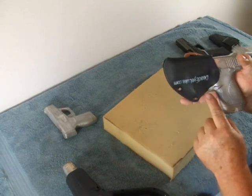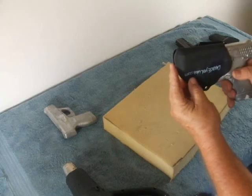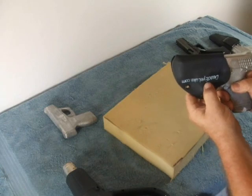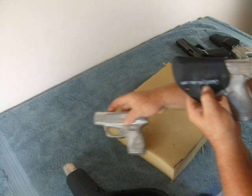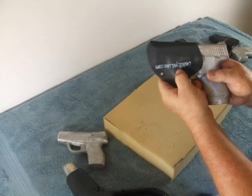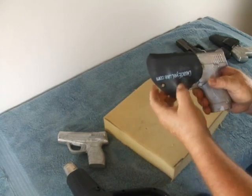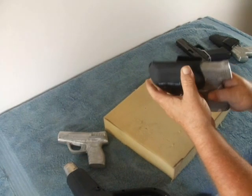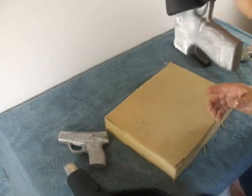You should see the shape of the gun embedded in the holster. Now it's still a little bit warm — you can see it draws in and out very easily. I'm going to put a little dent right here behind the trigger guard, then let it cool all the way down. If I pull it out early I'll push the dent back out and lose my retention. What I'm going for is just a little bit of retention — when it goes in it clicks and it holds the gun.